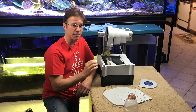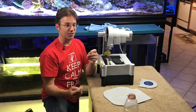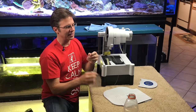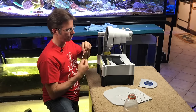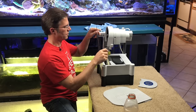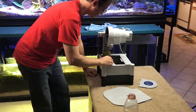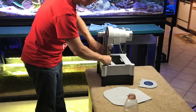When you have just a little bit of water — just enough to keep the blade damp — it works great. Now the blade has to be installed and there's a frontwards and a backwards. Make sure when you install it that you put the diamond-tip blade towards you facing this direction, and the smooth part goes in those two guides. I'll set it over the top wheel and then trick it under the bottom wheel. It takes a little bit — give it a few seconds.